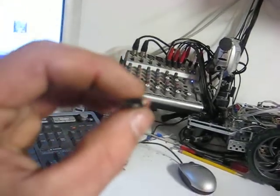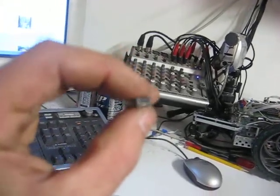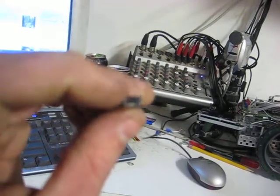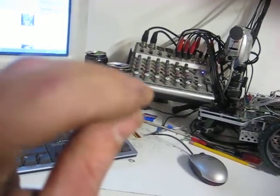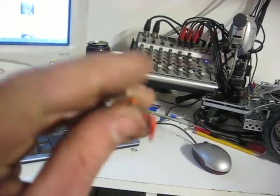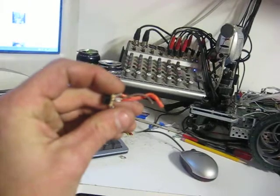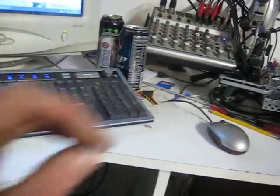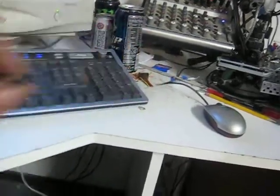This little guy has an infrared emitter and a sensor. If there is something white or reflective in front of this, the infrared light will bounce off the white — say paper or a mark — and bounce back and trigger the sensor, which sends a high signal to your little robot brain.